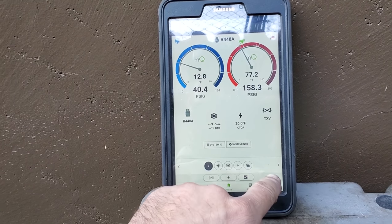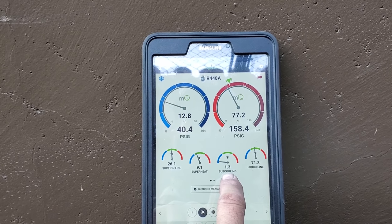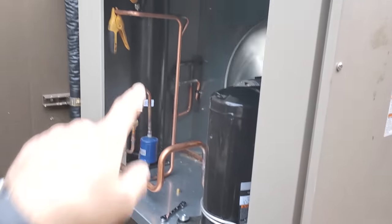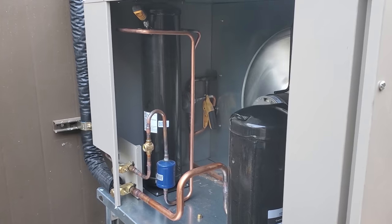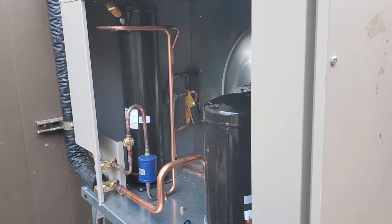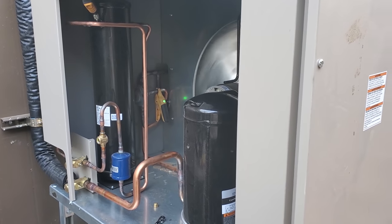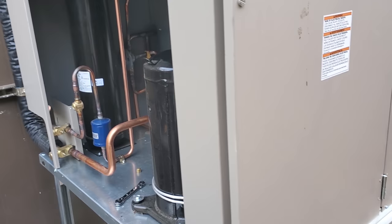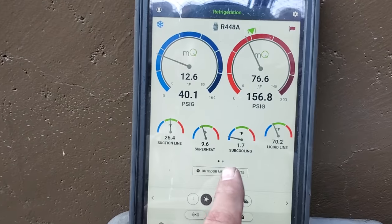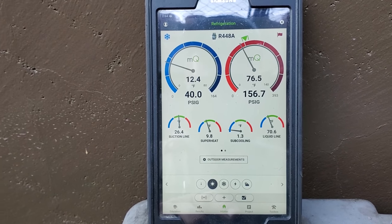Final numbers here. My unit's looking great. R448A. The subcooling's really low because you're never going to get a great subcooling number measuring on the liquid line. I swapped the liquid line probe to the liquid drain coming out of the condenser — that'll be a much more accurate subcooling number. But still, it's not a valid measurement of subcooling on this guy anyway. It's still going to be all wonky. 9 degrees evaporator superheat. We're really cold in the box right now — actually, too cold. Outdoor air 62, discharge line 126, 27 degrees inside the box at the moment. 15 degree evaporator TD, 13 degree condenser TD. So we're running fine.